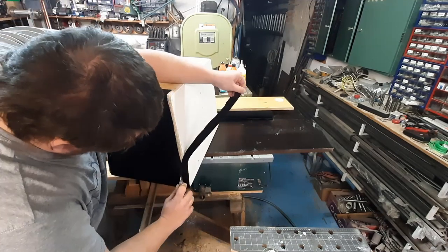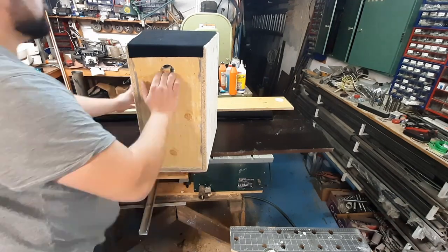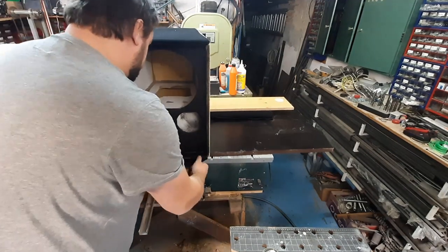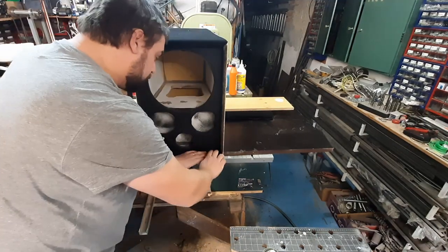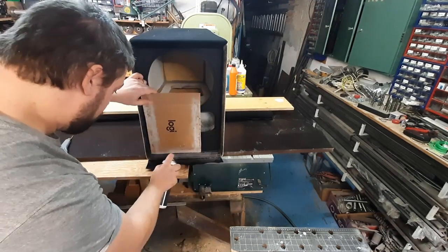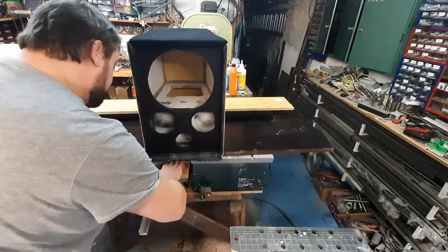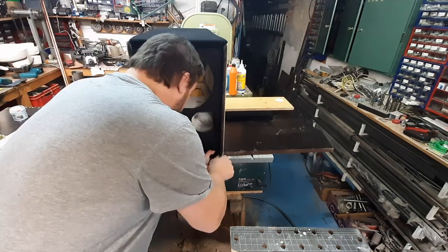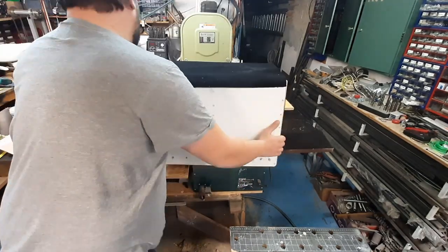It's actually, who would have thought, because it's really unusual to have a speaker with a million tiny holes right through the membrane. Even the TS parameters were saying the same story. In free air, the speaker acted completely fine. When put in a closed box, there was some sound and some noise, some parasitic air rushing through the membrane.